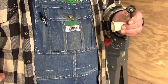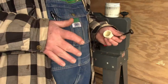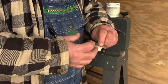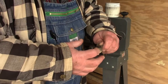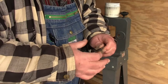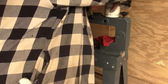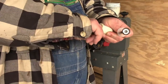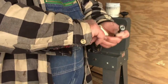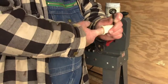Another reason to not over-oil: this is a blower — it blows the dust off of whatever you're cutting so that you can see your line to cut it. If you put something oily in there it's going to get on your wood, and that's going to screw up your ability to finish the wood. So that's another reason why I wasn't real keen on putting oil on that. I am going to put just a tiny, tiny bit up and down the tube — make it smoother, make it happy.